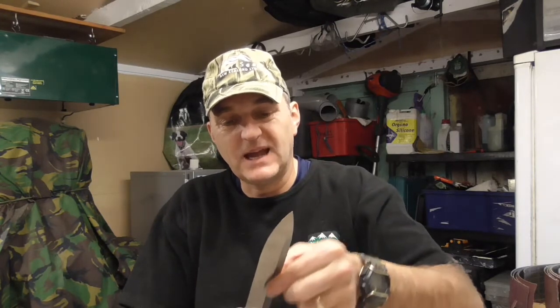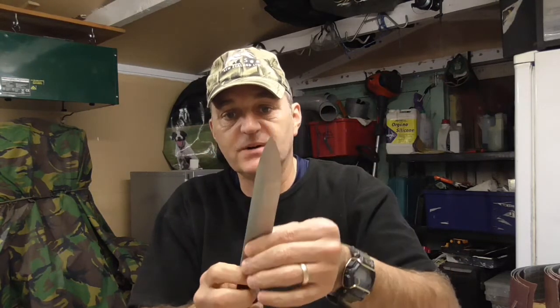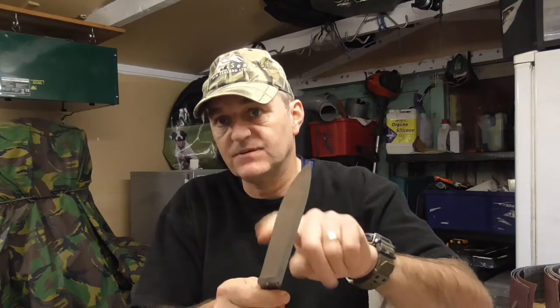I also put a sort of half height grind on it. Then the second one was actually 2mm steel, a bit more of this shape, but out of the 2mm. I've gone back to the 3mm and taken a high grind on it. I personally think this grind is going to be too high. On a 4mm blade, it would probably be very nice. On a 3mm, I think it's taking too much of the strength out from here to give it for abuse.